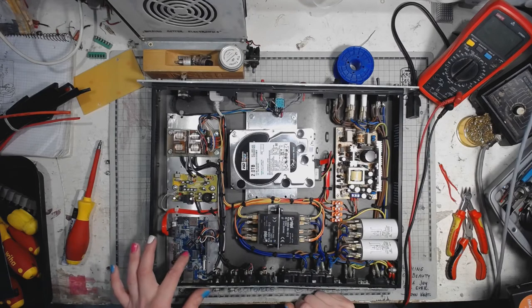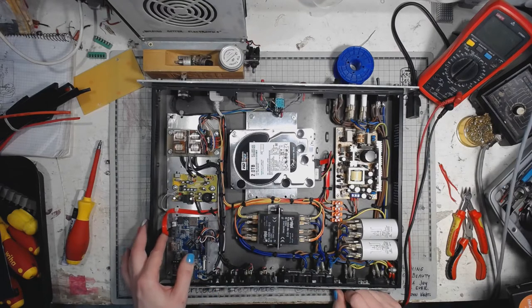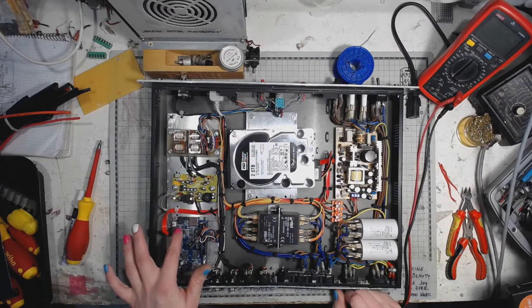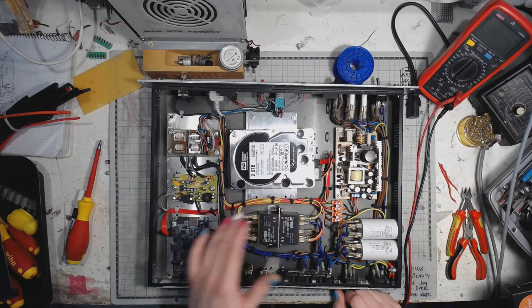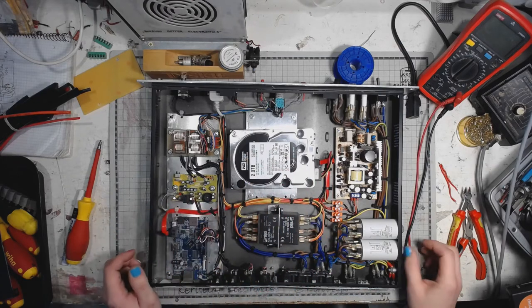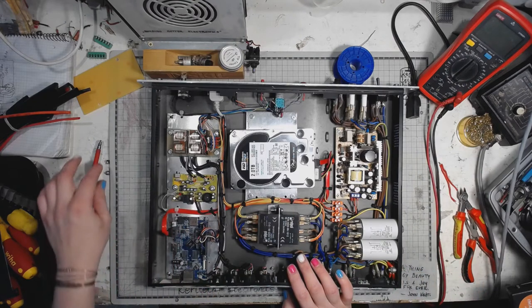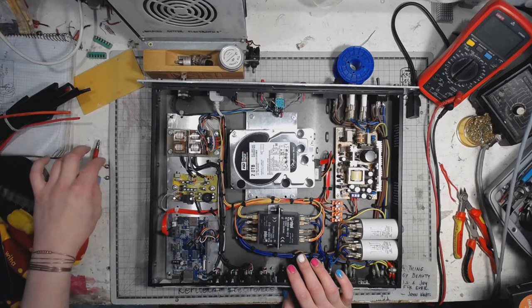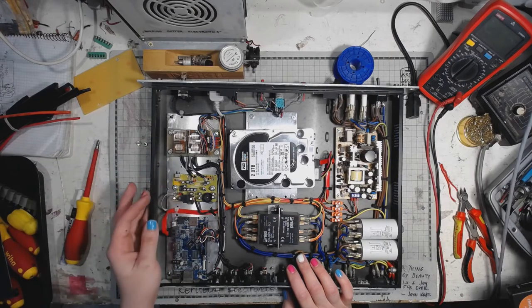I chose this single board computer for this application because it has a SATA interface that, as you can see, I use for this 2 terabyte HDD. Unfortunately, this board cannot work with larger HDDs. I learned it the hard way. It's a pity.